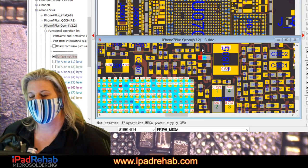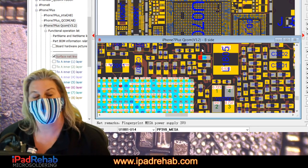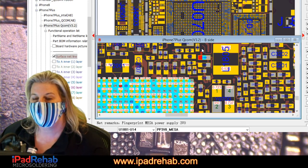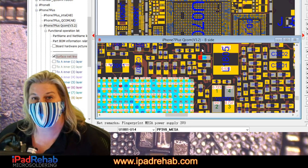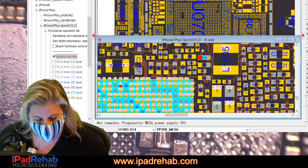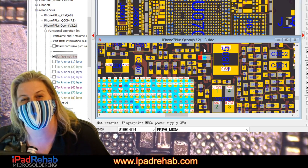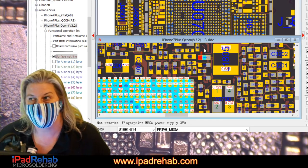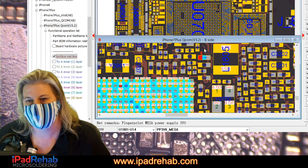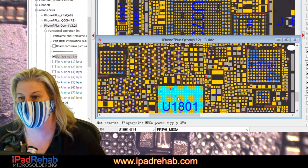So the strategy we're putting all this thought into right now is, can we identify and clear whatever is causing this 200 milliamp leak? If we could patch that hole so it's not leaking to ground, then we'd start at a blank slate to say, now can you boot? At that point we would start measuring things like whether the NAND is getting power, if it couldn't boot after we figure out where the leak is. But we don't have very much to go on with the question of where the leak is.